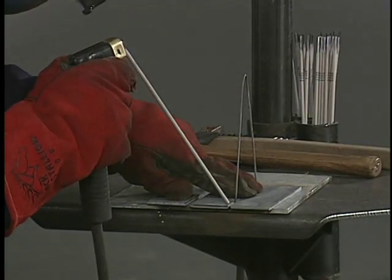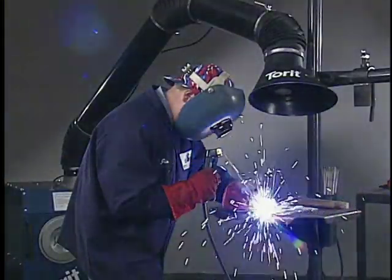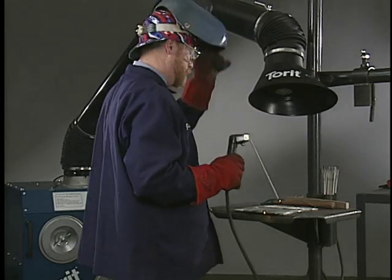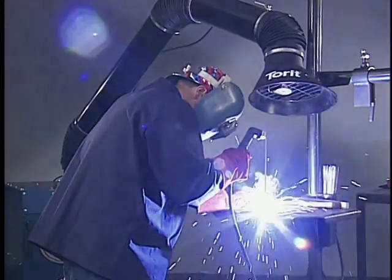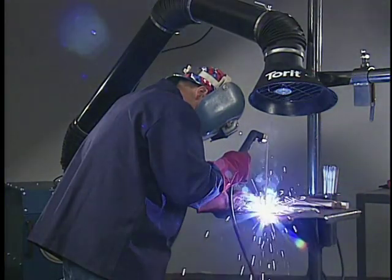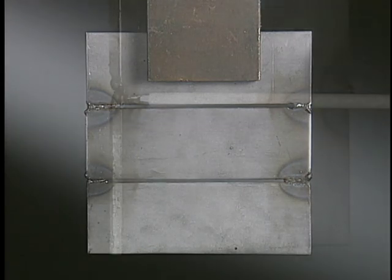To make the workpiece, place a 3/32 inch spacer between two plates and tack weld them together. Extend the tacks about 1/2 inch so you'll have something to tie into when you weld the joint. Strong tacks also help to minimize distortion. Add a third plate and clamp the workpiece in the horizontal position about chest high.